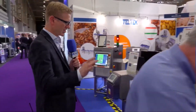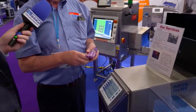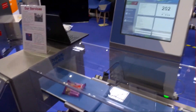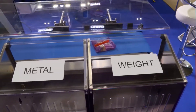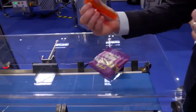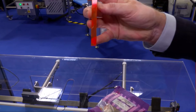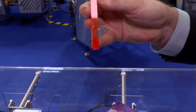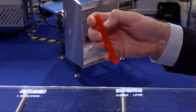How about we run it through again? This time we're not just checking for weight — although adding a bit of metal will change the weight, I presume. It will indeed. We have a piece of metal — it's a ferrous piece, two millimetres — and I pass it through. Here we go. You can see that it sees it on the metal detector. The weight increased slightly and it stopped it. Normally it would reject it off into the bin. 216 was the weight there. Let me put my hand in here — within this bar you'll see there is a two millimetre little ball bearing of metal, and that is what caused the reject. At the show they haven't got the pusher putting it out into the metal bin, so that's why the line just stopped.